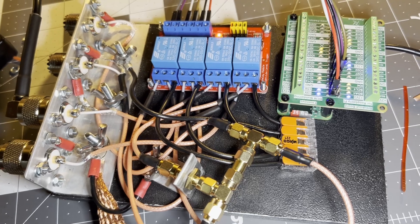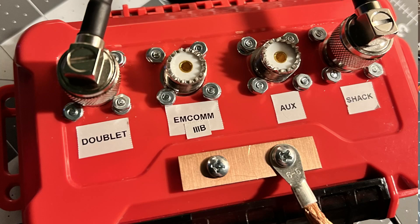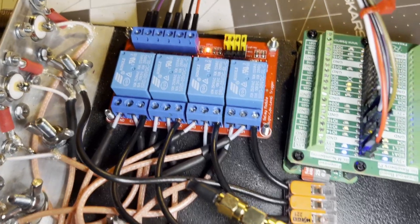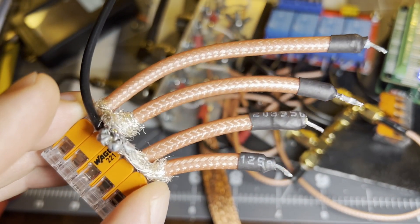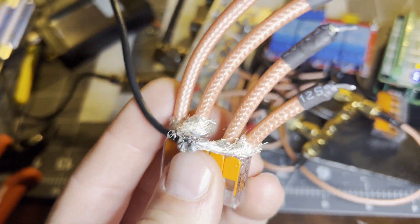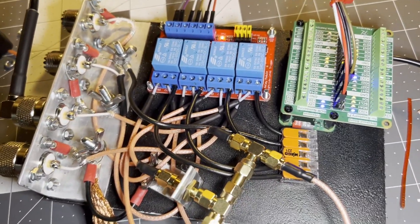Originally, when I first built this, I used a little red clamshell case I got at Ace Hardware. I just used plain unshielded wire and it didn't all fit very well in there. The unshielded wire was giving me high SWR. So I revised it and I made this board — I was using RG400, I think — and it was just super ugly and it wasn't working well. I did have better SWR, but I did not like the look of that. I'm new to tinkering with electronics like this and so I'm learning as I go, as you can see.